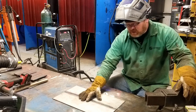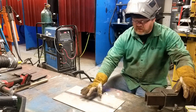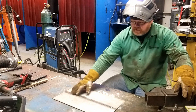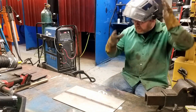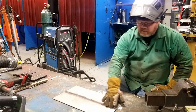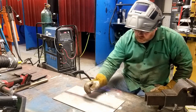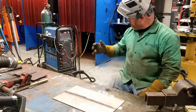What I've got is two stainless steel plates — two stainless steel butts. I've just fit them together. It's eighth-inch stainless, 20 inches long. The individual plates are six inches wide. They've got a series of tacks on them, and they've been tacked from both sides. I'm basically going to just run a tig bead down here freehand. I'm not going to add filler material, I'm not going to walk the cup, I'm not going to do anything fancy.